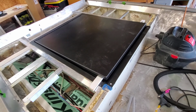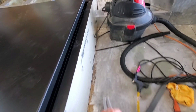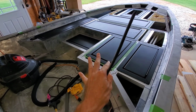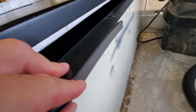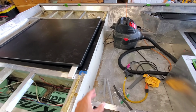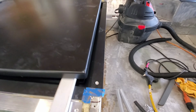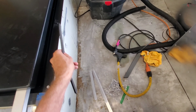I got this lid exactly where I wanted it, and then I went ahead and tacked 2 rivets in exactly where I wanted it. Now, we're going to run a slight overhang on all of my flats coming into verticals on everything that I do, because the verticals are going to get turf, and what I want to do is have that turf nice and flush to this edge. And then my turf up top is going to kill into that edge like so. And it should just look really, really awesome and alleviate turf overlapping turf and then causing problems later. So again, we're going with just a slight reveal. All right. And I'm using this piece actually to line everything up.